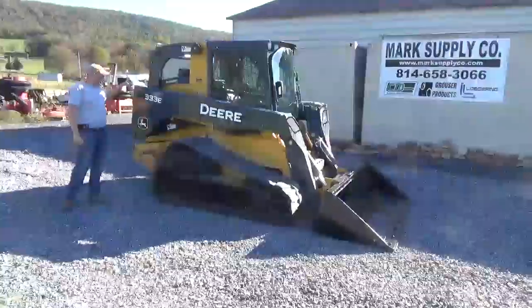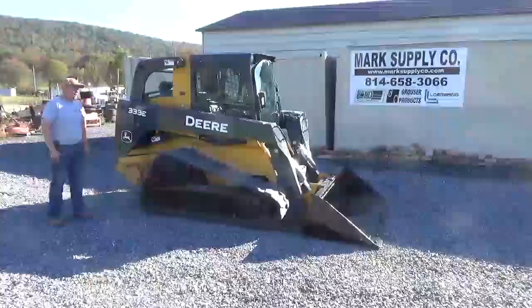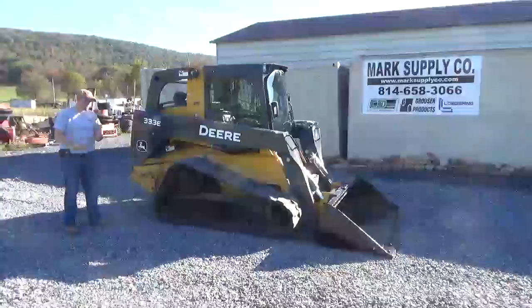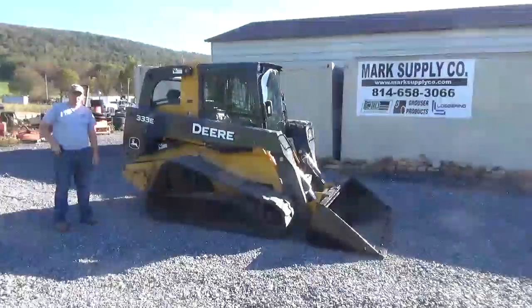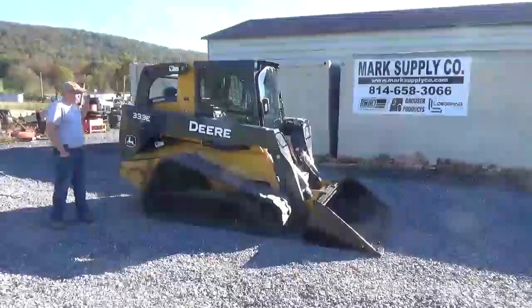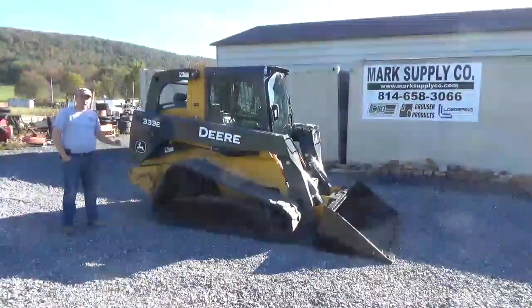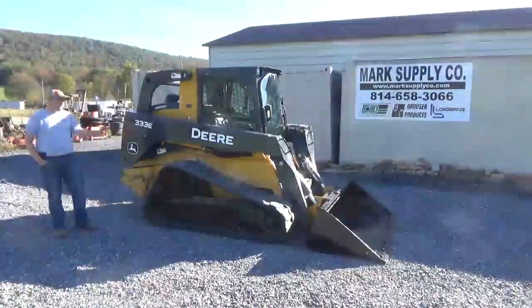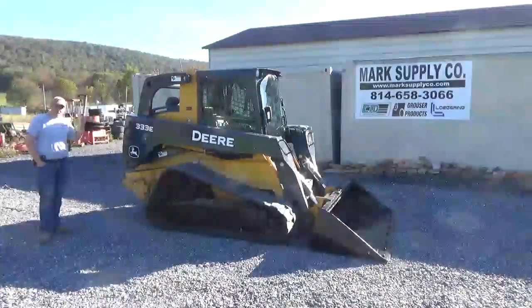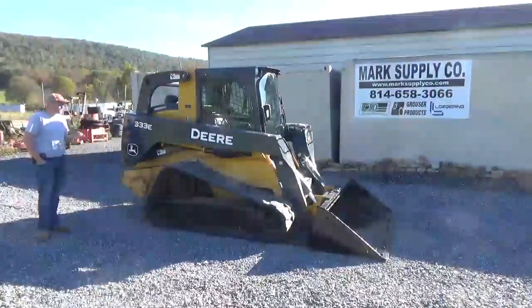series. Very impressive machine. I always did kind of like the D series John Deere skid loaders, but in the wintertime they really did have a struggle starting due to, what I've been told, electronic problems with their injectors firing. So they went to Yanmar on this, and they put the Yanmar 4-cylinder turbo on this, and this machine is a 99 horsepower. This is pre-urea, so you don't have urea.